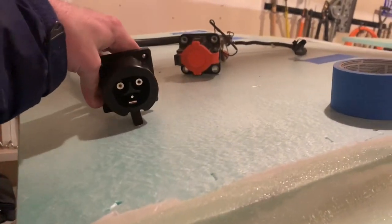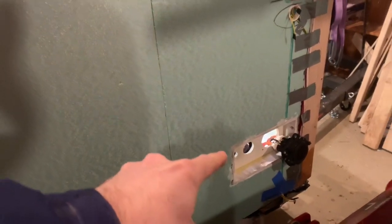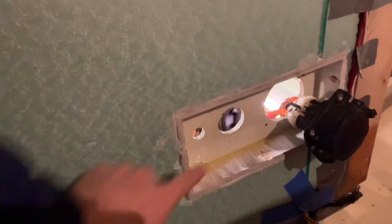Here are my two plugs. I do have another one of these that I've made for those two plugs — it's over by my fireplace, drying right now. I just wrapped that in fiberglass and resin. This one I already installed, so I just wiped resin on there. You really want all the stuff to be waterproof — it's not so much for strength because it's just wood and it's going to hold up — I just wanted to have some resin on there to keep it all waterproof.